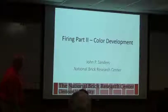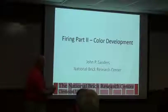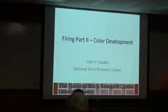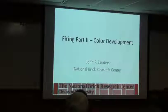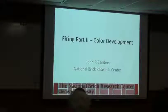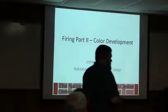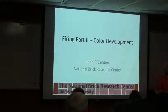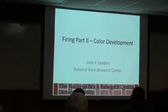Okay. All right, so let's talk about color a little bit. Remember yesterday we talked several times about how almost everything we deal with is a function of temperature and time primarily. Well, when you bring color in, you have to throw in atmosphere also. Those are three things from the kiln or your process. But we have to start thinking about material also, and how consistent the material is, how consistent the extrusion is, even how tight the body is.